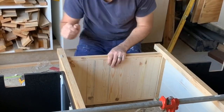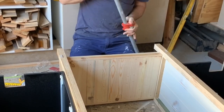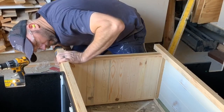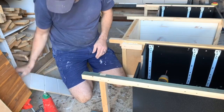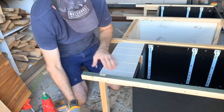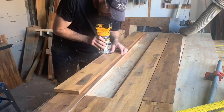Here's the shelves going in - bit of glue and screw action. Check square several times, don't want these to be out of whack. I'm just going to clamp it at the bottom with some screws in from the underside, so that's going to be more than enough to hold this shelf up. It's only going to be holding towels, but still I don't want it to break. I've got a little bit more of this cladding - I'm going to do up some false kickboards here, because those ready-made drawers aren't very high, so that's done the job nicely.